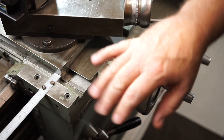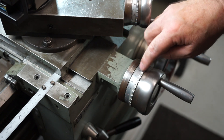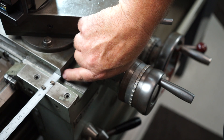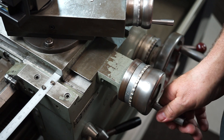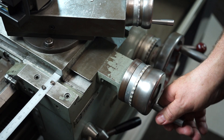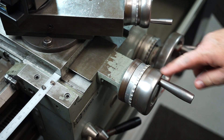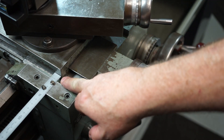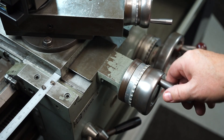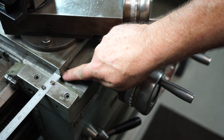When I'm doing the threading here, you'll notice a couple of things. I've got my cross feed set to zero and I've stuck my little 6-inch rule here with a couple of magnets. I have a gap there — so every time I wind off to clear the tool and run into the thread run-out groove, I can come back and know exactly where my start position is again. I don't have a digital readout on this lathe, so this is a handy little trick. You could put a pointer on there instead. If I'm one full turn out either way you can quite easily see it — it stands out like dog's balls.